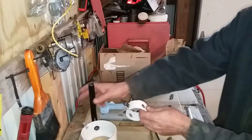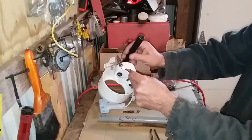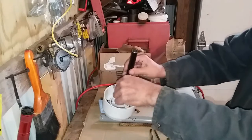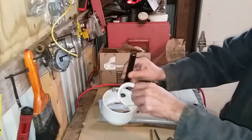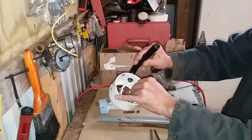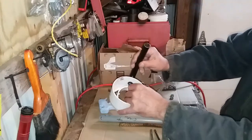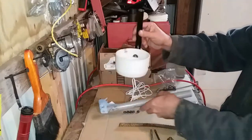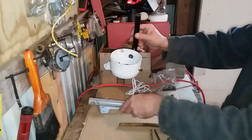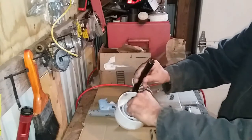Let me show you that close up. You need space for this to angle and get down in here, and it's not going to do it if it has that long gimbal hanging on it, see? So you want to put this one in first, and then your bearings and whatnot, and then after this one's in, then you put your final gimbal together, see? So I wanted to show you that. Okay, so